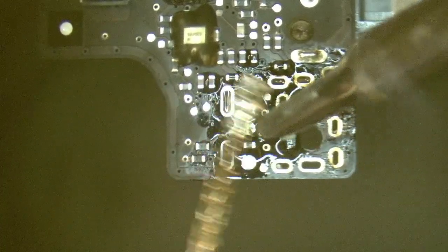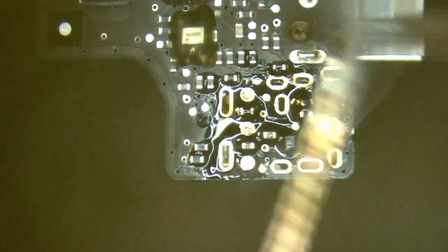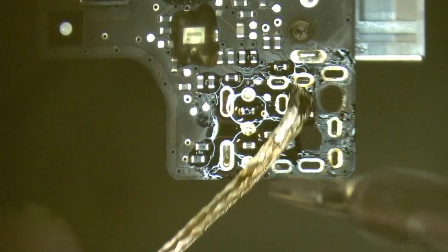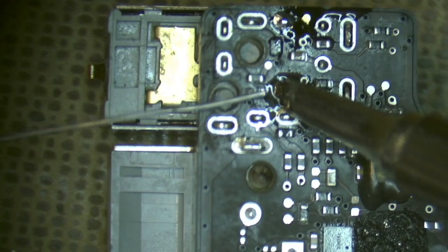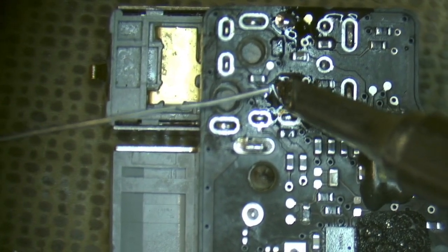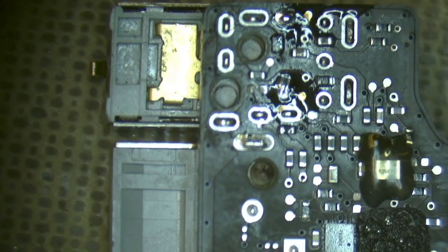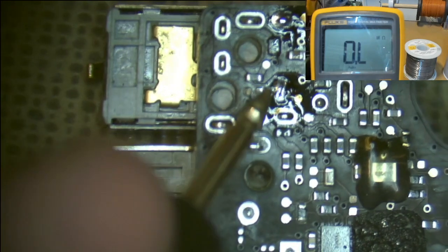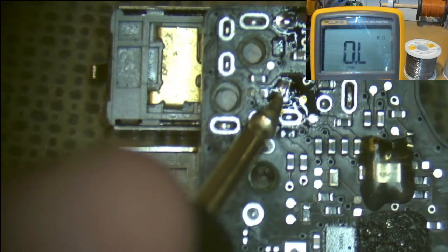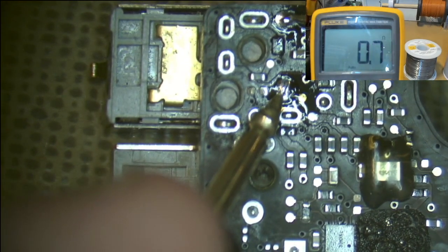While we've got a little bit of remaining heat on the joint, we're going to clean up those holes a little bit. We'll just solder in pins one and two and get a nice fillet. And before we go any further, we're going to make sure we have that short there, because it's just going to be a waste of time putting in the new socket and finding out we haven't got the short. And if we have a look there — we have the short circuit.